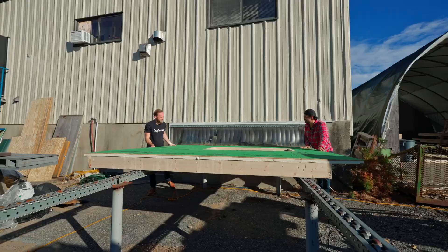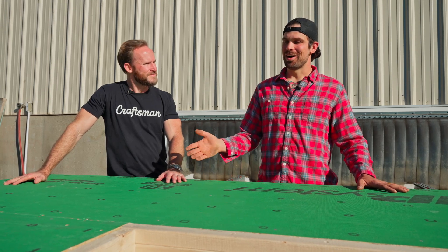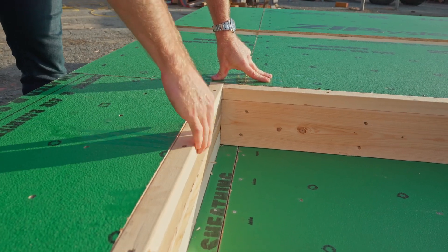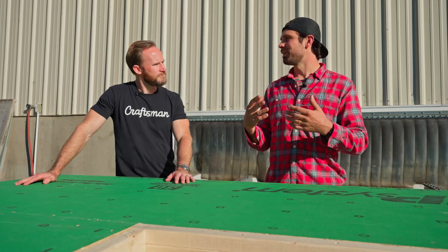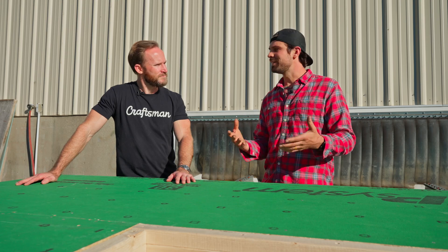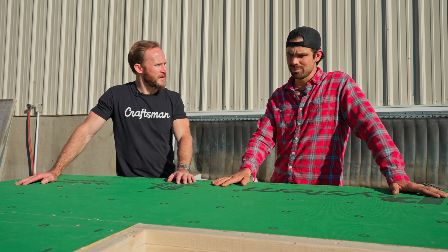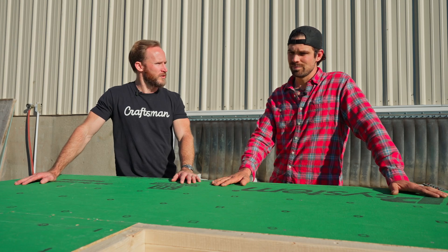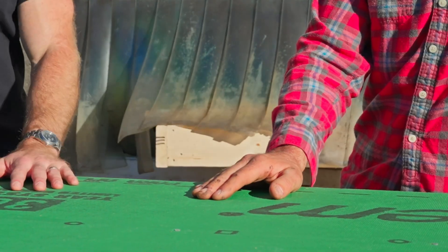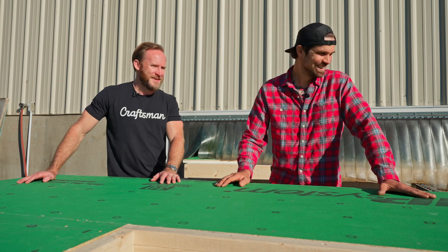It's really nice to see manufacturers like Anderson coming together to work with Mullen and Cape Cod Panel, supporting what they're doing and providing all the details to execute this properly. We're going to see more and more exterior insulation, so it's great that Anderson is putting out the specs and helping ensure it's done right — so you're not getting to site and having issues down the road. All the windows can be ordered, show up on site, go in, and the building is dried in within days. It really eliminates the 'we'll figure it out in the field' mentality, which is ultimately what leads to warranty issues and poor project longevity. Changes can happen here in the factory rather than out in the field exposed to the elements.